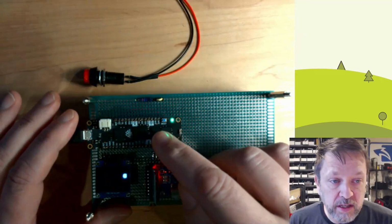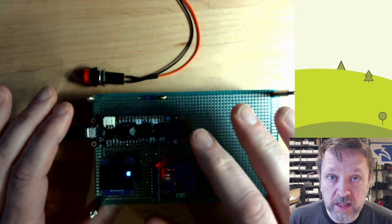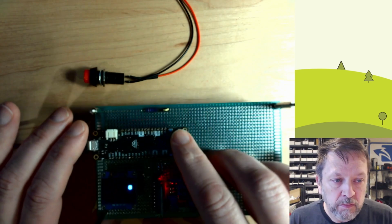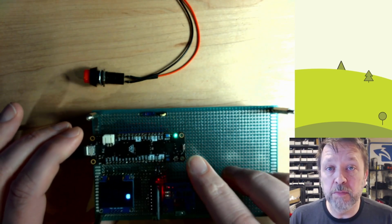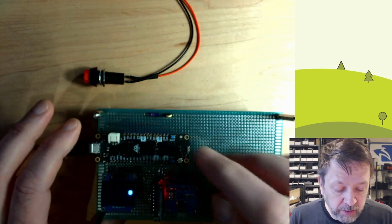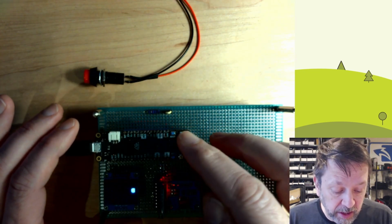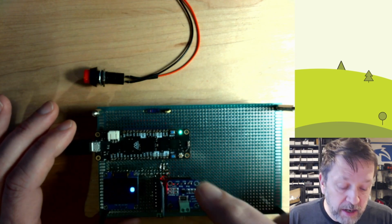This requires a single input on the device to be available. Most of the time, you'll have at least one available after you've done all of your other circuitry. So adding something like this is really simple. It gives you some extensibility of your platform. It adds the ability to do some debugging things that are challenging to do, especially in the field. And really, it consumes a single I/O. Most of the time, I've got at least one I/O left over that isn't being used by the solution. So I usually add something along these lines to make my life simpler.